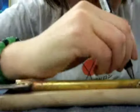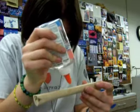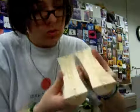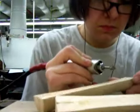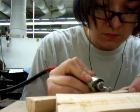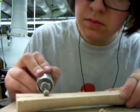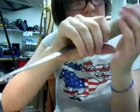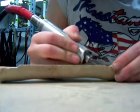We then split the wood and determine where the tang should fit into the handle. This takes a little bit of measurement, and you have to be careful — if you're not, the tang could sit crooked in the handle. Once we're sure everything's centered, we have to carve out the middle so that the tang fits into the wood properly. Even though we know roughly how deep to go, we still have to be slow and precise, carving away a little bit at a time with constant checking to see if it fits.